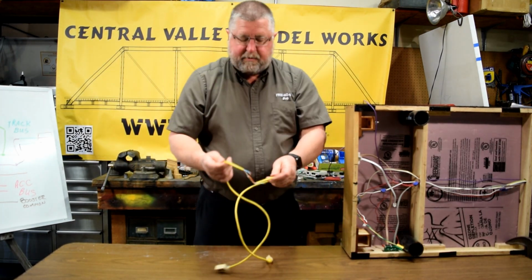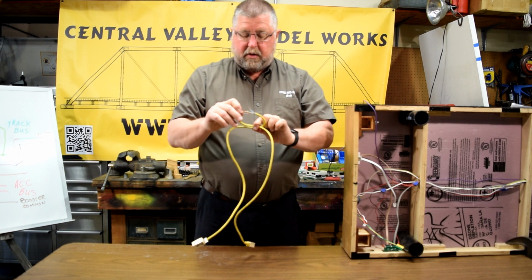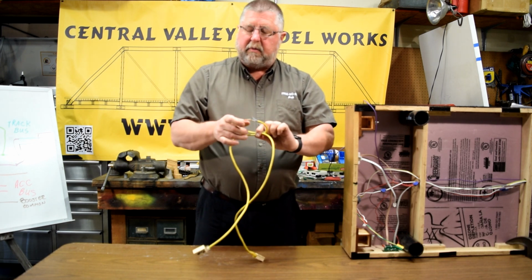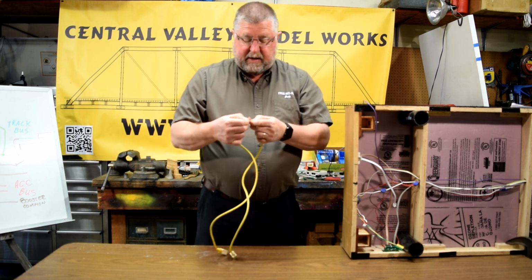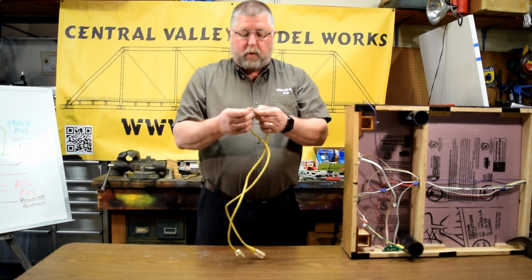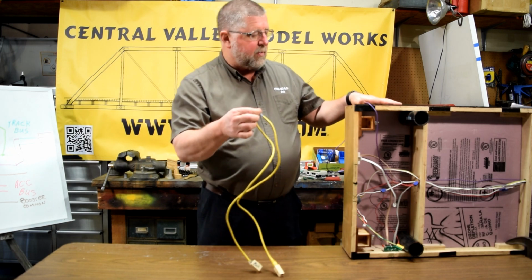And then I like to take my wire and I'll do a service loop in the middle like this and put a wire tie on it. Then you break out and take the insulation off. You break out the blue and white wires, and you take the white ones, you keep them hooked together, you keep the blue ones hooked together, and those hooked to your BD20. The white is the ground, and the blue is the logic. And that's all it takes, and this module will be finished.